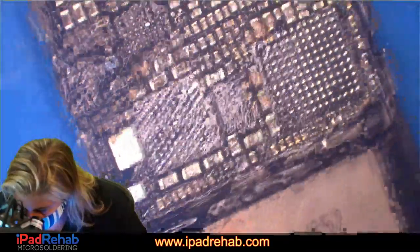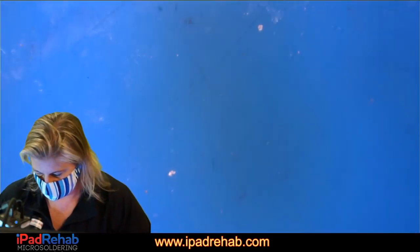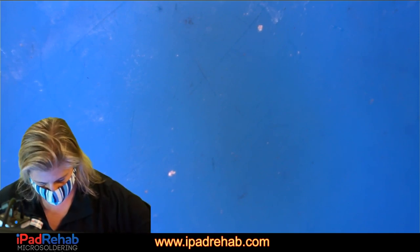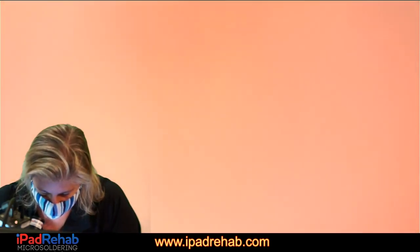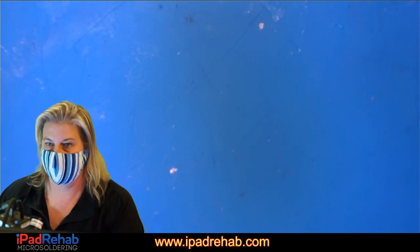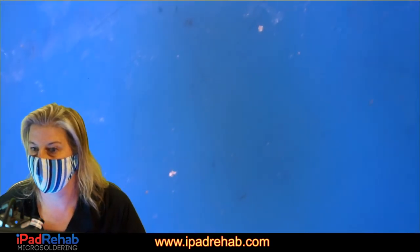Okay, let's see if we still have our 186 milliamp leak. Yep, we still have our 186 milliamp leak. Let's see if the heat at the audio IC is still there, or is it gone? Maybe it was actually on the other side of the board. So let's check that out and see what happens.